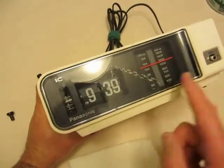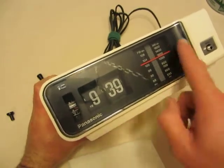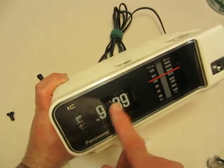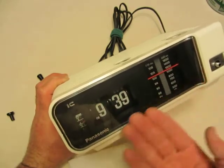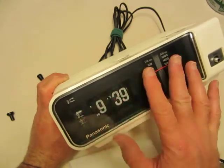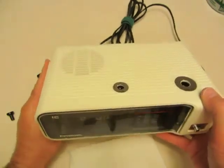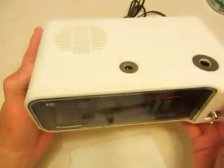As far as cleaning, this one's actually fairly clean. My problem area is that the chromed paint has come up, but this is a good quality front piece — actually better than the later models, because in the later models the plastic seems to be softer and will scratch easier. They've glued this in place, so to clean that I like to use ammonia on the backside — straight ammonia works really good. Slosh that around a bit, then warm soapy water followed by a regular rinse. Then distilled water, shake it out, and let it air dry. You get a really nice clean result.